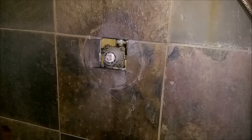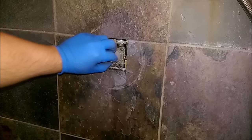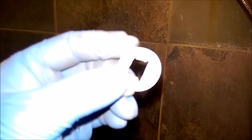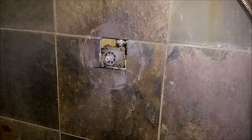Now you're looking at the cartridge. Before we go any farther, you get this little paper thing here — this paper tells you what model your valve is. You can see it says Pfister. This little thing does have the model number; this one is 26000-0100. So if you have that same one, you're looking at the exact same valve you'd be getting.